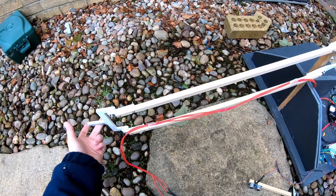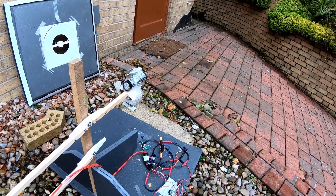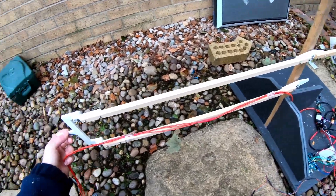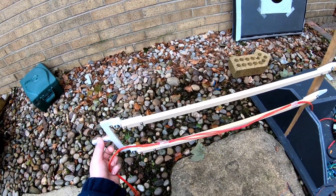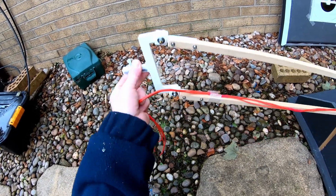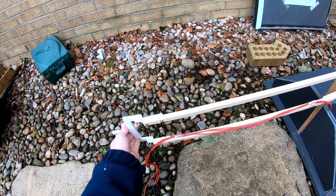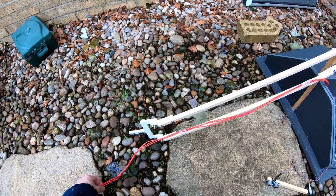So here is a quick overview of the hardware. My linkage is on ball bearings, and it's got a counterweight made of whatever stuff I could find sitting about the garage, so it moves with very, very little friction. I would probably make it a bit sturdier in retrospect — even a double parallelogram linkage rather than just the single — but it's good enough. It is constrained to moving more or less up and down; technically it's an arc, but close enough. It's reasonably rigid in all dimensions, so that's our kind of restriction without restricting.